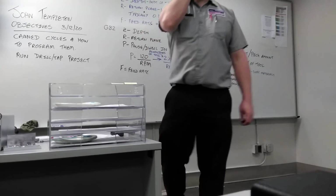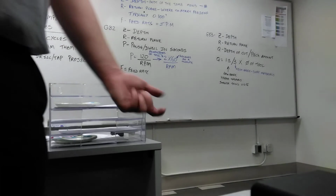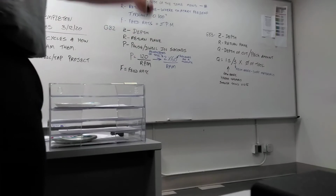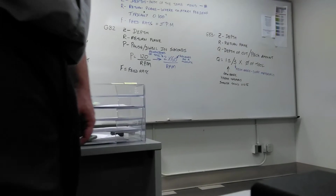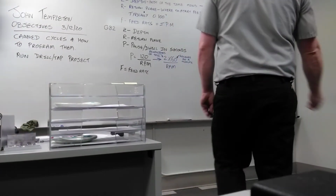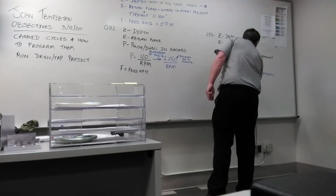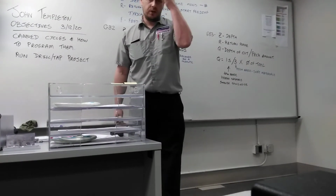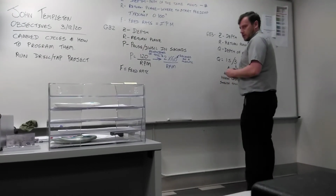125 thousandths and under, I would classify as a small tool. So 125, 100, 75, 50, anything that's smaller than 125. That doesn't mean depth, it just means diameter. Under 125 in this case. So under 125. The high range is for larger tools.